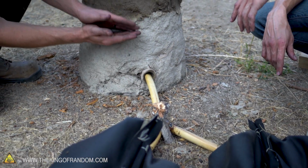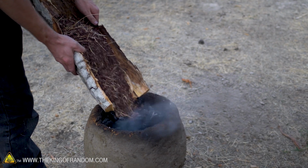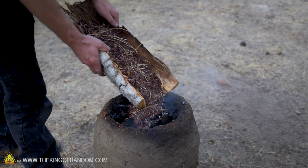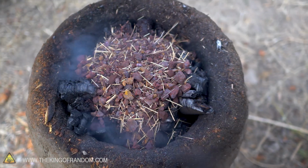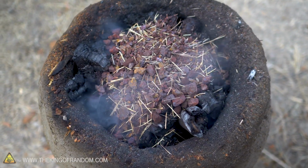So what will happen is the iron bits are going to turn into iron, and then as they come past here there's a danger that they'll turn back into rust. Fortunately, we have a secret ingredient also included in the ore, and that is the glassy stuff, the sand. And so that's going to melt and coat all of those little particles of ore, protecting them from the oxygen until they settle down here in the bottom zone of the fire. Let's pump some air. Let's do it.